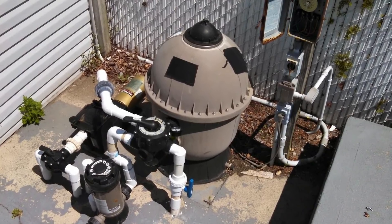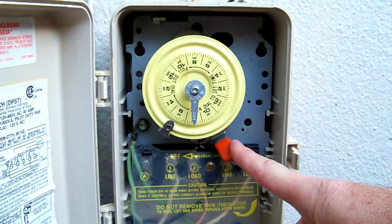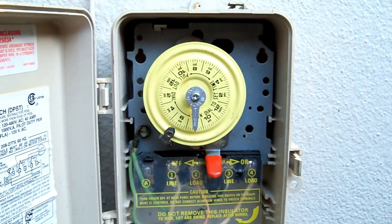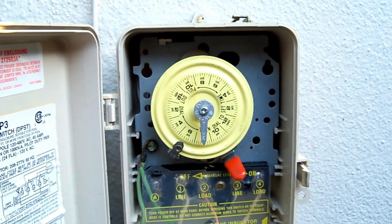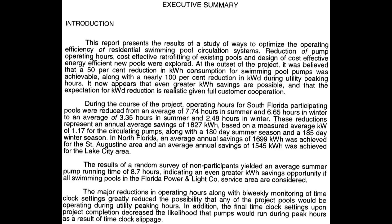Now the caveat is this: you'll need to get a few more on-off trippers and position them around the clock in one-hour intervals. You can run your pump motor from 12 to 1 in the afternoon, 6 to 7 PM, and then finally 3 to 4 in the morning. Basically, you want about a seven to eight hour spread between the one-hour cycles. According to this study, this is adequate enough to filter your pool water and circulate the chemicals.